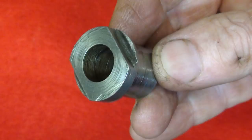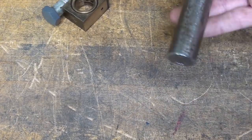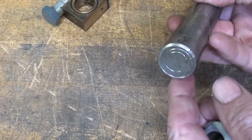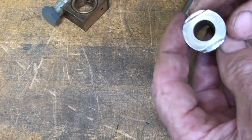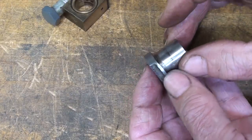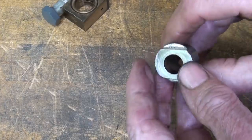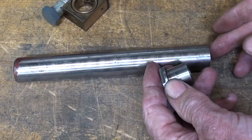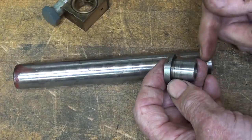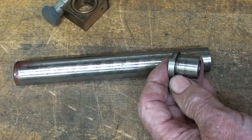But this is today's project. This is one-inch diameter, so here's a piece of one-inch stock. I'm not sure what it is, but it's not just mild steel — it came from Caterpillar, so I hope it's not too tough to turn. If it is, I'll switch to some other stock. It's a half-inch hole, and this is turned down to what I just told you. It'll be cut off and milled. Watch the order of operations: I will start by putting the work in the lathe, facing it, turning it, boring it, reaming it, and then turning this diameter — all while held in a three-jaw chuck without taking it out. Let's go over to the lathe.